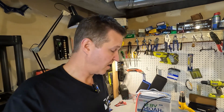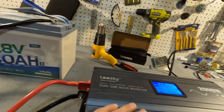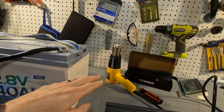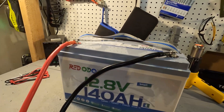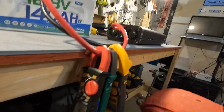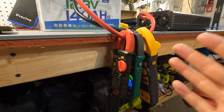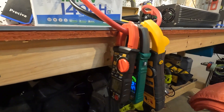When I purchase a clamp meter, the biggest thing I'm going to use it for is measuring amperage. So let's compare the Tesman along with the other two clamp meters I usually use. Right now I have a 2000-watt Leesky inverter connected to a 140 amp-hour battery powering a heat gun on high, which is drawing roughly around 110 amps — the app shows 109.6 amps. All three clamp meters are lined up together; please let me know in the comments if you think they could interfere with each other.